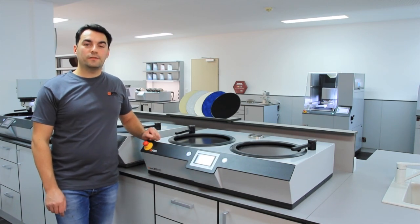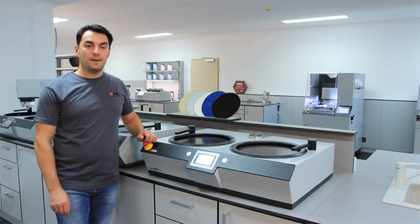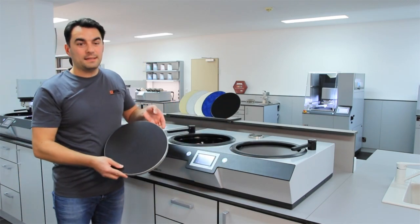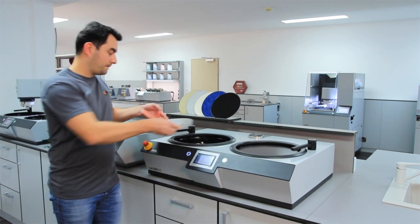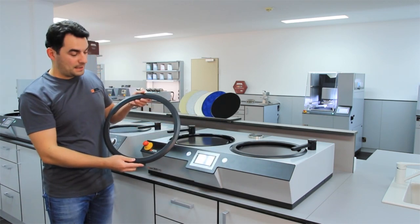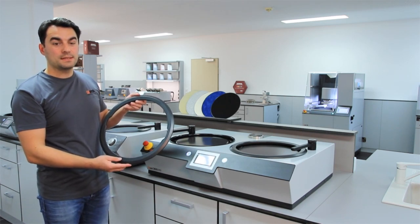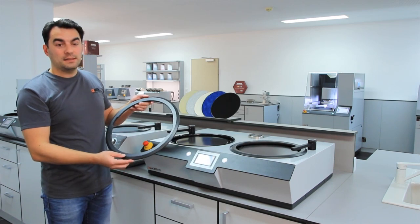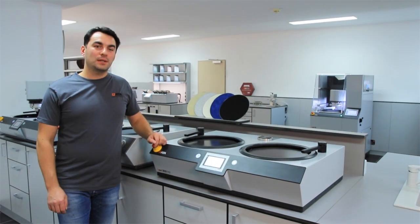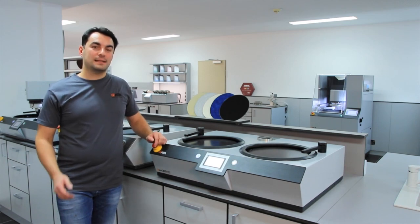Let's start with the overview of the machine. The machine has a powder coated aluminium housing which is very robust and has a clean design. The maximum wheel diameter is 300mm. The splashing ring has the same ergonomic design like you know from the QPOL 250M series. The pockets enable easy change of consumables. The working wheel fits on the cone which makes the change of the working wheel easy, fast and tool free.